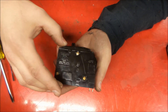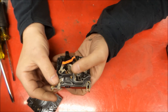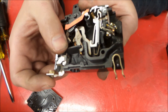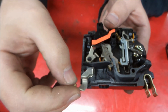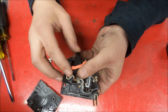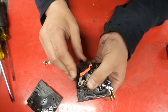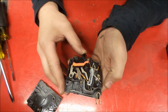We'll see if we did this without completely screwing everything up inside. You can see what's inside here — there is spring tension on some of this. Here's our contact — it goes right to this bus connector, which connects right on the bus in the panel. There is your contact tip, and here is the mating contact tip right here. That is not going the way it should — it should push over like this when you go to the on position, but for some reason this mechanism is not resetting.